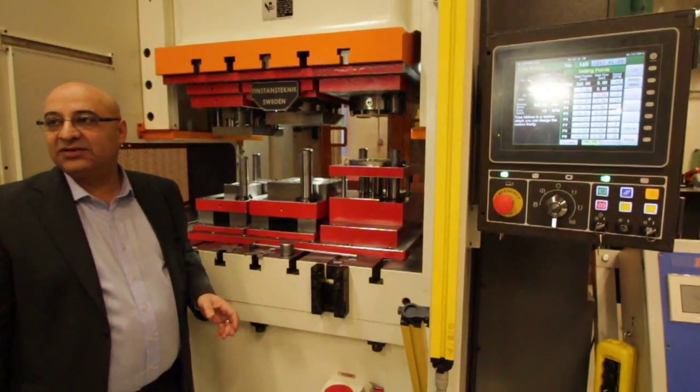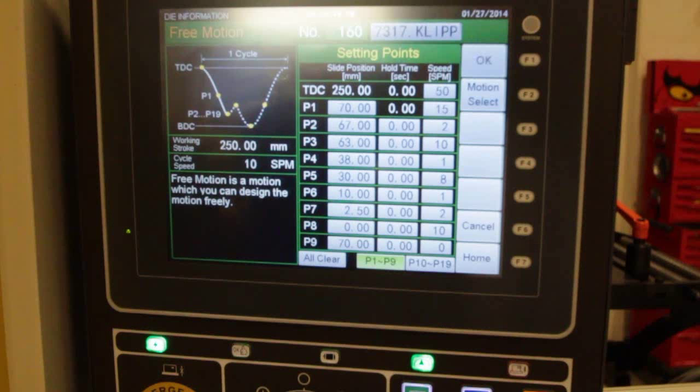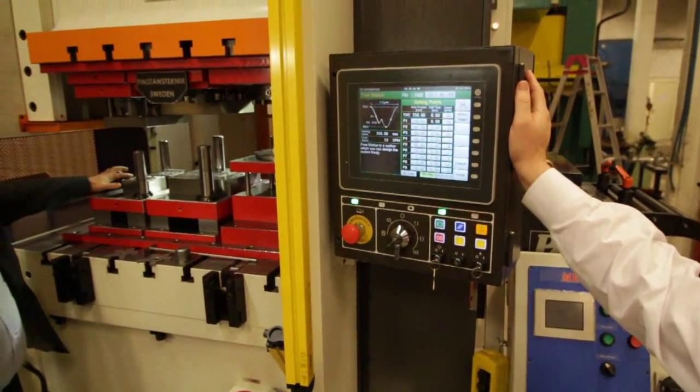So actually without this I can go very fast in this surface and cut after that. The machine is very fast. I'm going from 67mm to 63mm with speed of 2. From 63mm to 38mm I'm going with 10mm. 38mm is here.